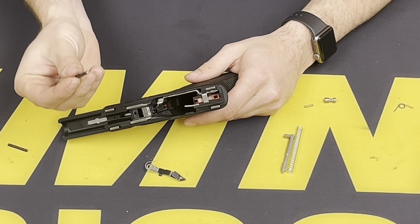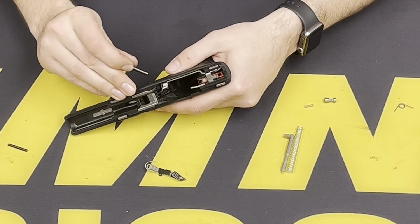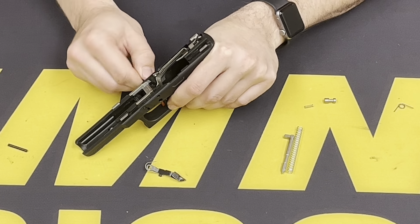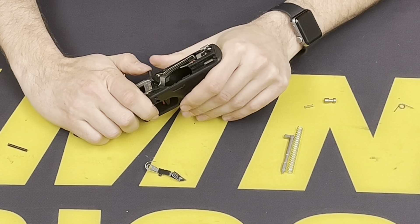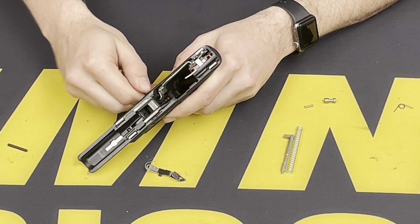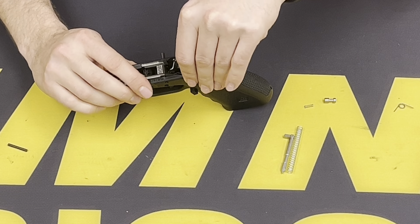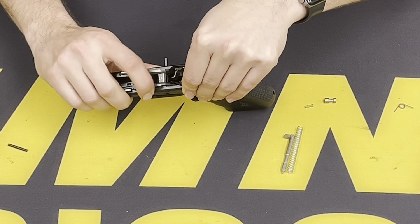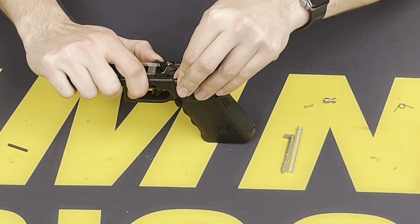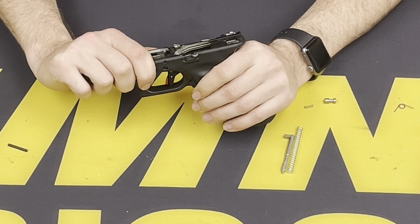With your top pin in, we can go ahead and insert the trigger mounting pin. Make sure that the trigger lines up through this hole. Slide it in easy — it shouldn't be interfering with anything. When you go to push it, you want to bring it back out about halfway to allow clearance for your slide lock to be inserted on the left-hand side of the trigger. Once that is aligned in the hole, go ahead and apply a little pressure to the pin. Move it around if you have to, and it will slide into place.